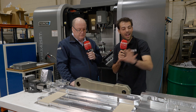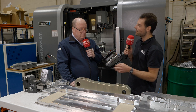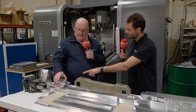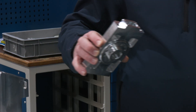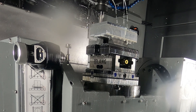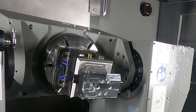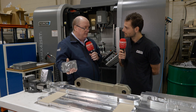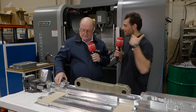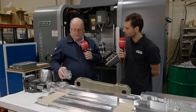These components are absolutely lovely — there's a huge range of different types, and they all look like five-axis components to me. This part would be a five-axis — as you can see, there are five different sections that are going to be machined, and that all gets done on one machine. That's a negative angle there, and we can do that on the trunnion on that five-axis. And without the negative angle, would it take an extra operation? That would take an extra operation — you would have to make a fixture to get that angle.